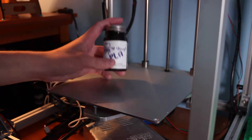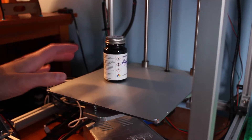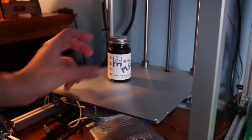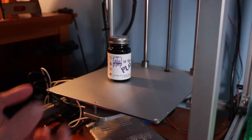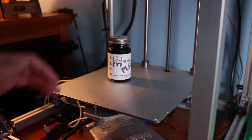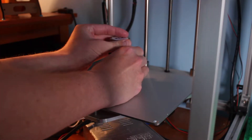When it comes to plastic solvents, 3D Gloop is really pretty much on the safe side, but it's probably not good to get a lot of it on your skin as it is a solvent and that can mess with your skin. So if you're ever working in large amounts, I would suggest using gloves and possibly a respirator if you're not in a well-ventilated area. For quick application on the bed, you're probably fine without gloves as long as you don't get any on you.